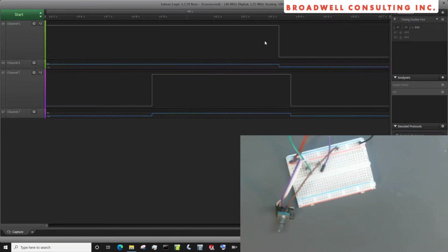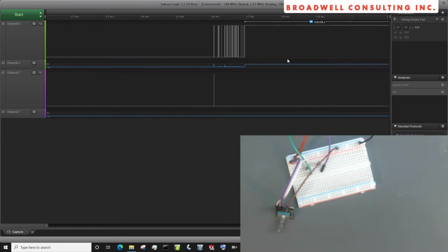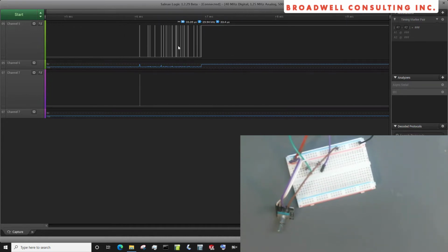Again, transition high to low. This was high. And it stayed that way for a pretty long time. On the other hand, we will go over here, low to high, and we're still low. We can see that we're getting quite a bit of bouncing in here. And this potentially is important, almost a millisecond worth of bouncing on this particular logic analyzer, which I found to be a bit more sensitive than what the PIC seems to be in terms of picking up interrupts and whatnot.